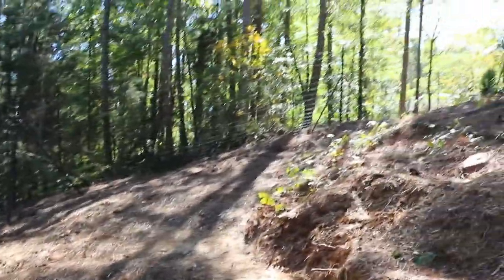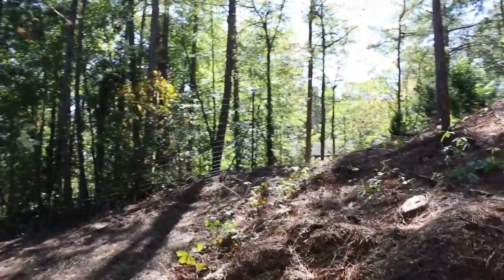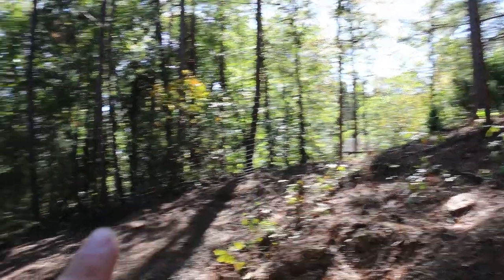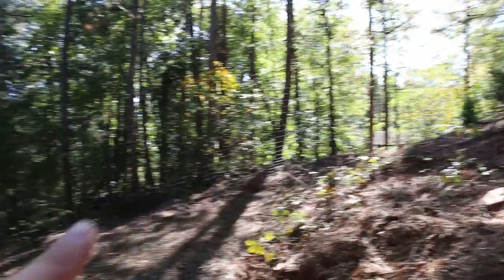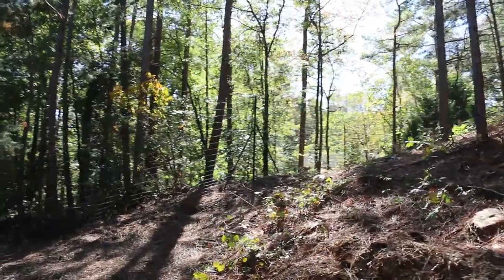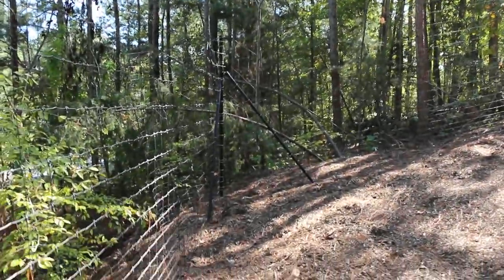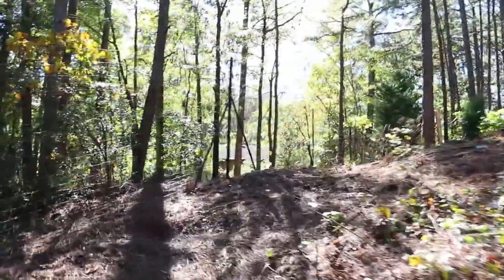So I got this hill all regraded. I set a post at the top so I could pull one piece. So there's a seam in the fence there, and it pulls down to the corner here, so I had to regrade it so you're all on the same angle so you can pull it tight. And then I started with another section and went the other way. And then you've got a post that's supported on both sides so that you can pull on it. And obviously we got the other side of that corner done. So we're all fenced up through here